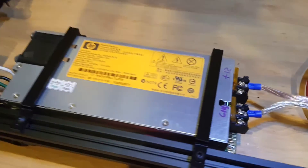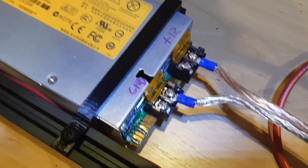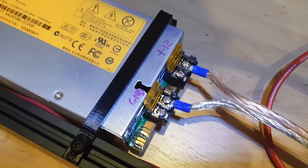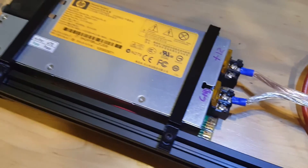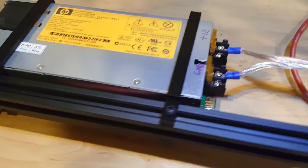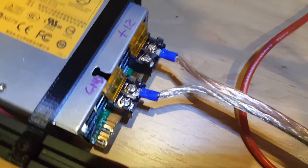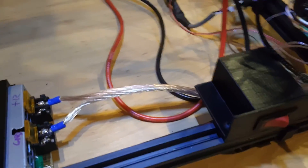After I finished soldering the resistor and the connectors on the power supply, I plugged it into power to verify that it works - and it didn't. It turned out that the 1k resistor, despite what I had read online, was too large a resistance and the power supply did not turn on. So I replaced that resistor with a 22 ohm resistor, and this one works fine. Now my power supply turns on and supplies power. Here it is hooked up into my printer with the brackets - the STLs for the brackets are available. The two connectors - two positions are being used to power my controller and the other two positions will be used for the MOSFET to power the heated bed, so that will be one of the next steps.